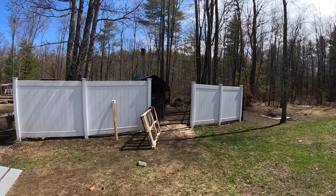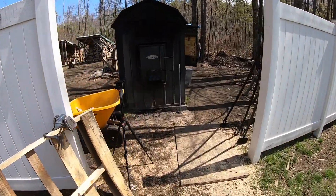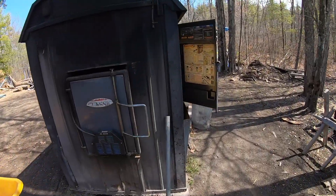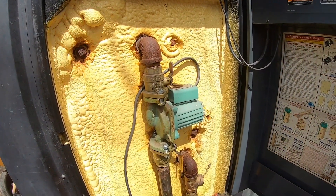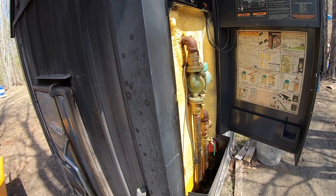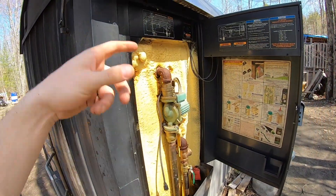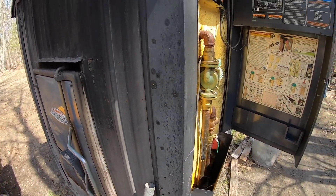Back at the boiler — everything is powered down and the damper is shut. The last thing you want to do is unplug your circulator pump here. That way, if anybody goes downstairs and turns that breaker on by accident, you won't be circulating any water. The worst thing that'll happen is just opening the front damper door.